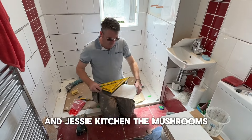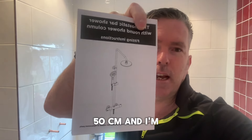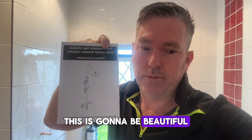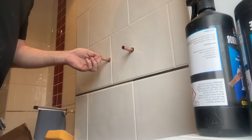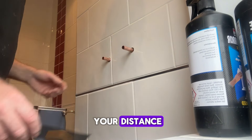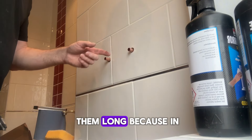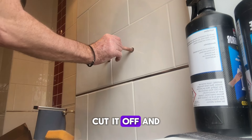You've brought your shower pipes out at 150 centers and I'm going to go through it step by step — how we fit one of these bar showers with the overhead. It's going to be beautiful. First step is to clean. If your pipework is fixed in the wall, you measure your distance and cut it, but because these aren't fixed in the wall, I've put these in with enough pipe to push them back. We're going to leave them long because in the future if you ever need to change this, you can just pull it out, cut it off, and put your new pipe on.